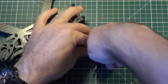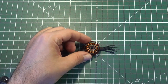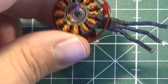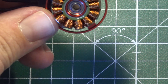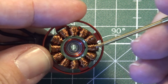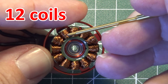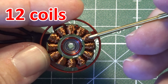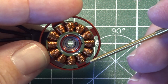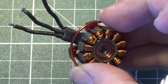Dirty but working. Okay, that helped. What we have here is a stator of an electric brushless OutRunner motor. There is a lot of wire wound on the coils, and this is important: there are always 12 coils in the motors we are using — not 10, not 14, but exactly 12 coils. On those 12 coils there are wound three different phases, which are then connected into three wires leaving the motor.